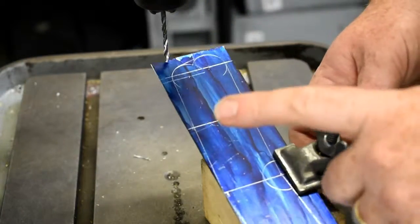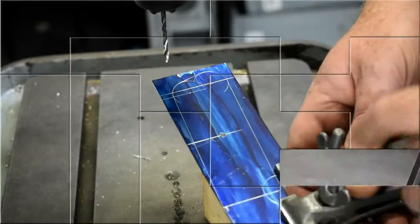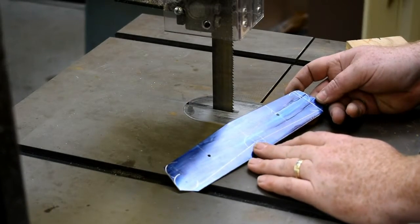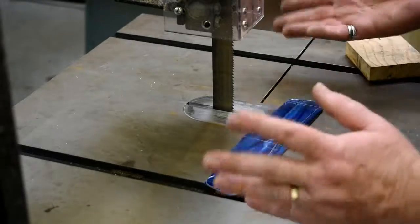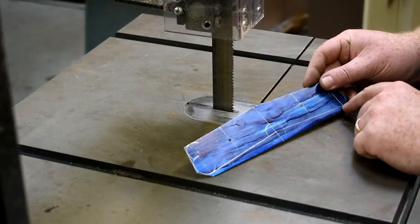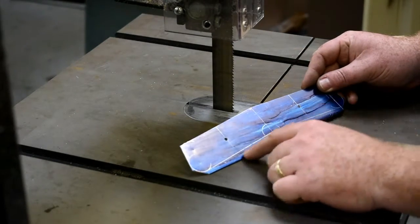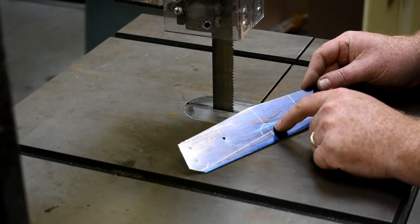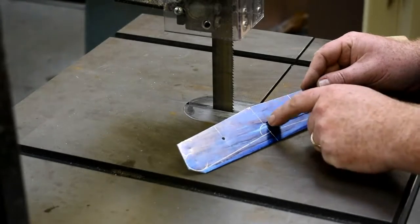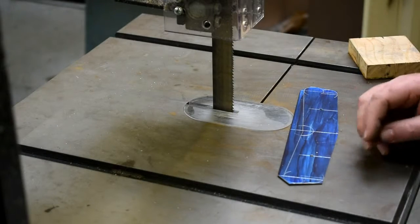At this stage I'm going to go over to the shears and cut off as much as possible. I can do the sides here but I can't do the back. You're going to have to use a hacksaw or some other tool to cut this out. Because I'm the teacher, I get to use the bandsaw, which saves me time. I'm going to cut a straight line up here to that point to remove this section, and then for the curvy bit I'm going to cut a V in — that's what you'll do with a hacksaw too — then use a round file to curve this.